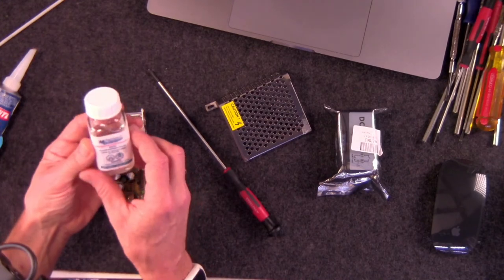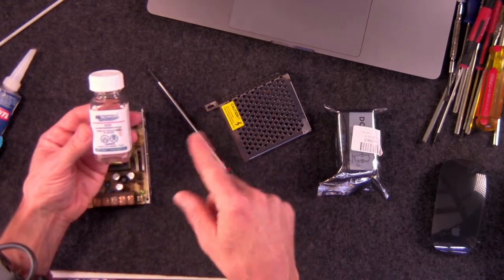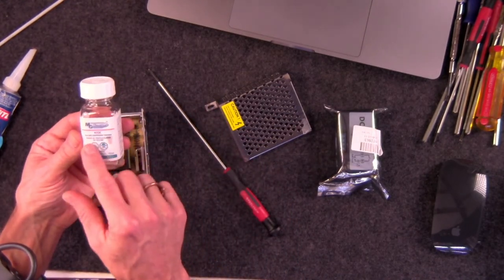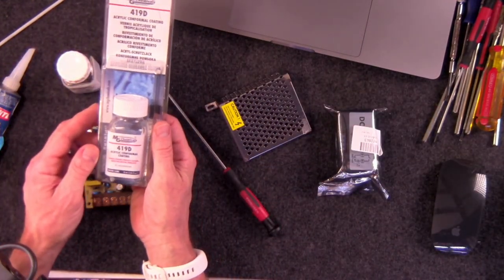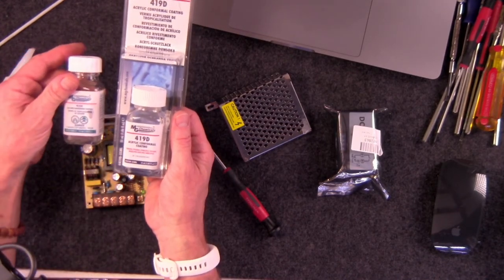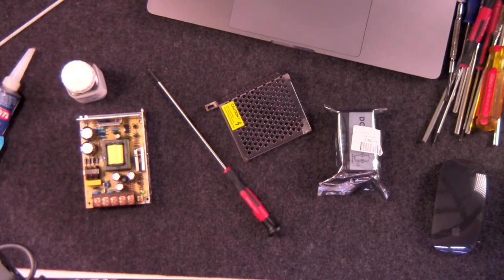A really wide temperature variance, you'd want something with a silicone base, just like you would with the caulking around your windows and doors. You'd want it to be silicone-based to absorb that temperature fluctuation. I think that's why they're doing it in that case, but you can use either one. Both will be effective in our application. Either one is totally fine. Either the 419D or the 422C is fine for grow rooms and indoor situations, anything like that.